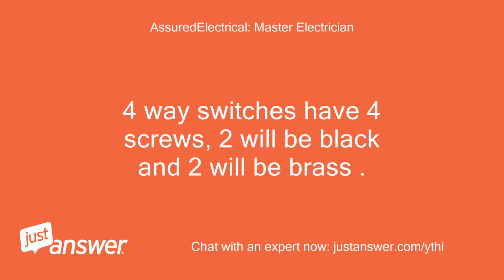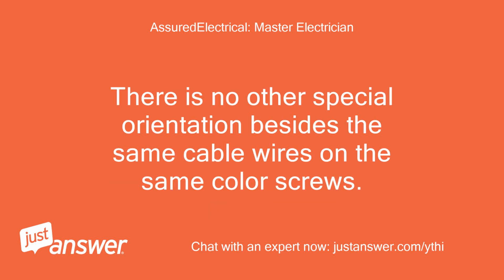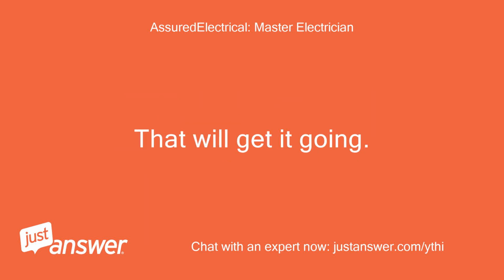4-way switches have 4 screws, 2 will be black and 2 will be brass. Red and black from the same cable will connect to brass screws, then the red and black from the other cable will connect to black screws. There is no other special orientation besides the same cable wires on the same color screws. That will get it going.